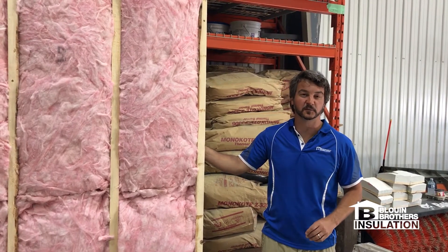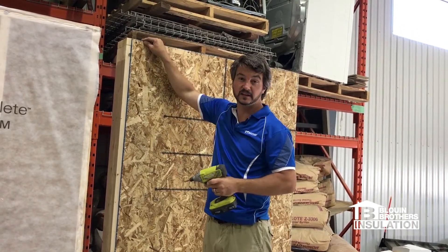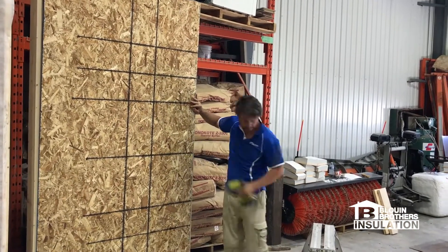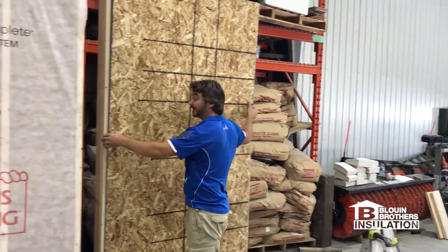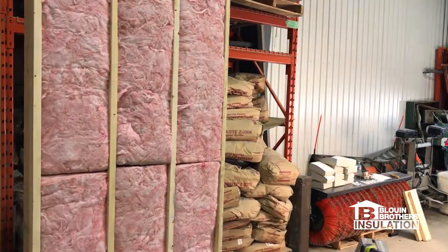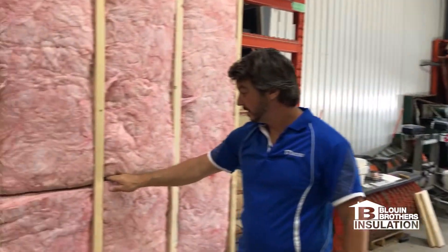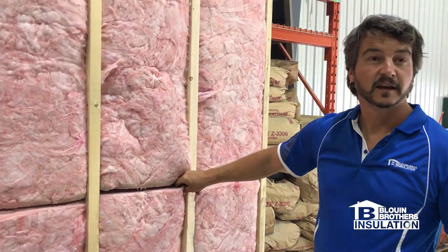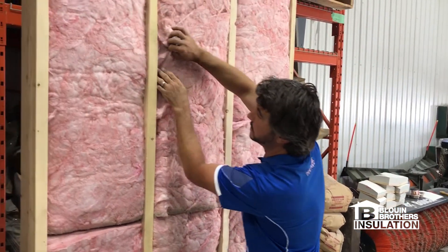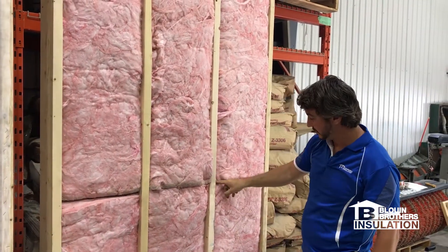And it's really going to be an eye opener. Typically you don't have this opportunity to remove the back of the wall to actually see what the outside looks like. So let's just see what kind of system we have. I'll remove this plywood — the whole face of the batt insulation looks great. What you don't see are the imperfections in the batting. Now if both sides of the wall were open, you can obviously come back and adjust and fix the insulation. So what happens when we have this void back here, we're getting heat loss.